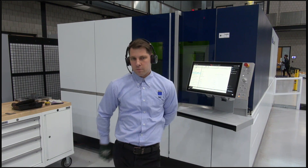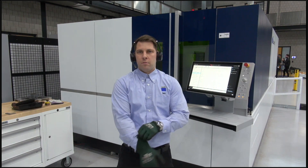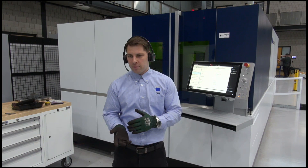Alejandro asks what mix we're using. We have nitrogen primarily with a little bit of oxygen mixed in — 3.5% oxygen. That can vary anywhere from 2% up to 5 or sometimes 6%, depending on thickness and grade of steel. Generally we find 3.5% works for most materials. If you go over that, it causes issues because you're introducing too much oxygen but not burning it like you normally would with oxygen cutting — so it causes problems. On some materials with different carbon or silica contents, very low oxygen contents can actually be helpful, but for general A36 like we're running, 3.5% is pretty good.